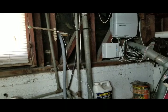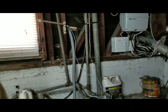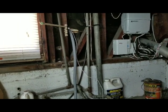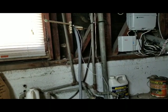This doesn't have a three-way valve because this family does not use bleach at all, so that was their choice. But at some point if they move out and they want to keep the gray water system, then a three-way valve will need to be placed into the system. We'll see you next time.